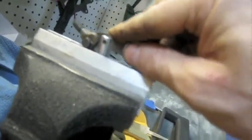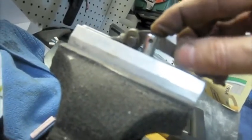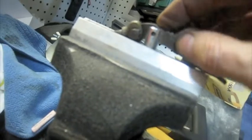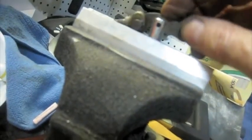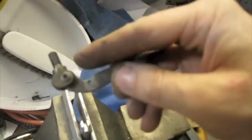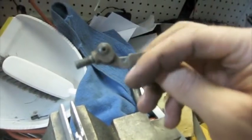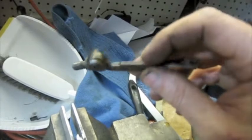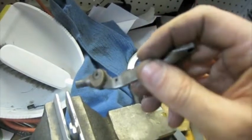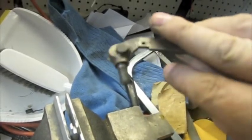You can see — or maybe you can't — but the hole in the clutch lever doesn't quite line up yet with the hole in the piece I'm making, so that slot needs to be a little bit deeper. Also you can see this rectangular groove in the clutch arm where the old piece used to engage it — I think that just wore down over the years. I'm going to take this to a welder or machine shop and have that filled in and filed flat again.